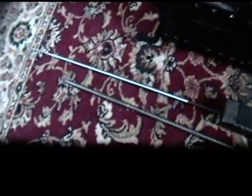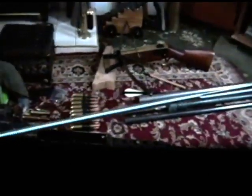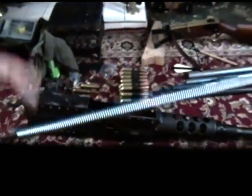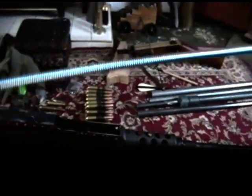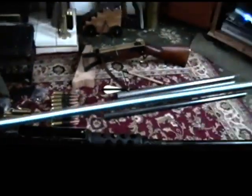So the other way I could do it is, if I pull that rod out, I could clamp this rod in the vise and I could get a blowtorch and warm the spring up and spin it round with my finger here with a glove on or pair of pliers, spin it round and try and get a continuous temperature over the whole spring. Then I could just quickly, while it's warm, get a pair of pliers on each end and try and expand it out.